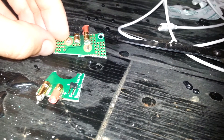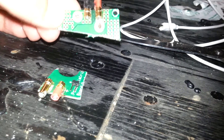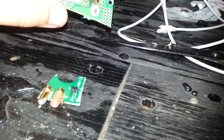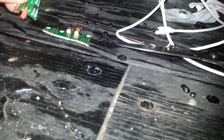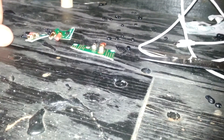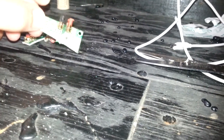The whole thing — that's it, nothing fancy about this. It's just a tiny little thin strip of copper, and there's no way. It's probably not even the equivalent of a 26 gauge little copper wire, probably less than that. So no wonder I was having current problems and my ESCs and motors were burning up.